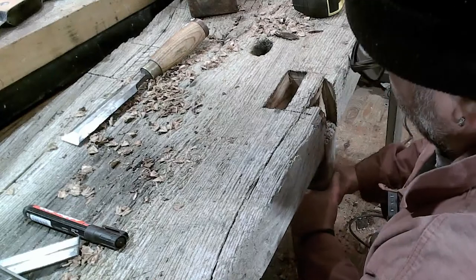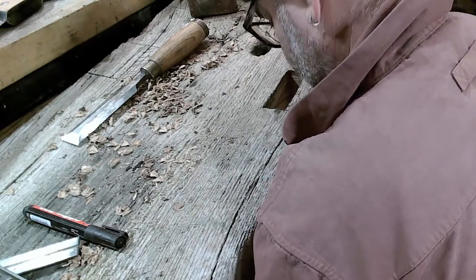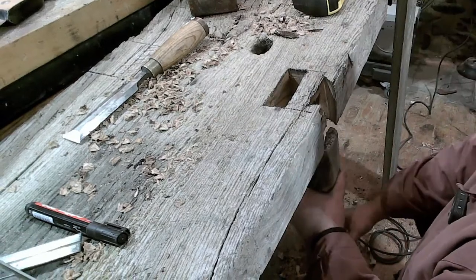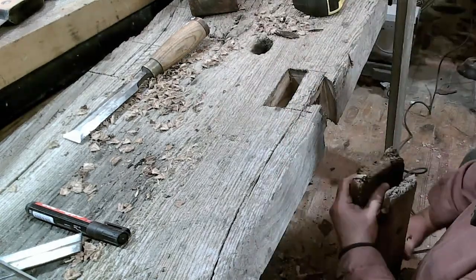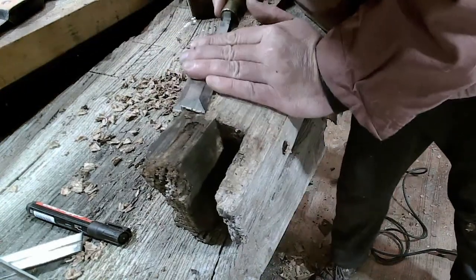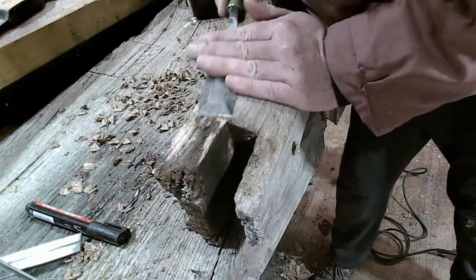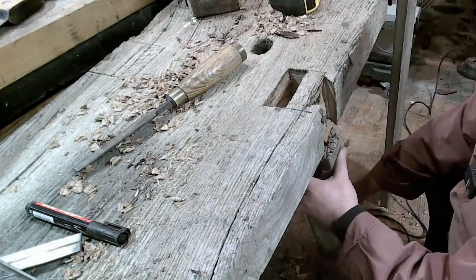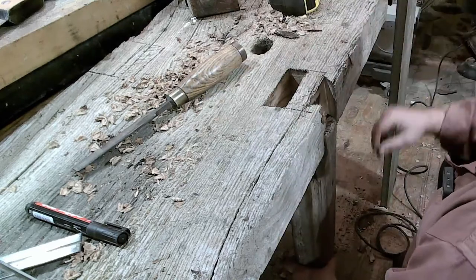Oh, a bit down there. I think the dovetail's okay. Might be on the toe side, but I think that will be okay. Yeah, that'll be right. I've got to take a bit more off the mortise on the right hand side, or I might just trim the side of this to fit, either with a hand plane or a chisel. It's all crank banky anyway, like that thing. Wet, I know that much. Oh, looking hopeful.